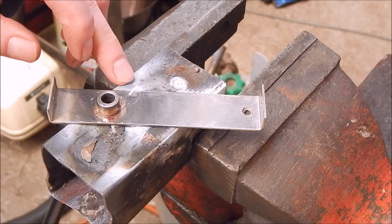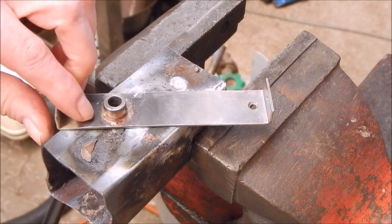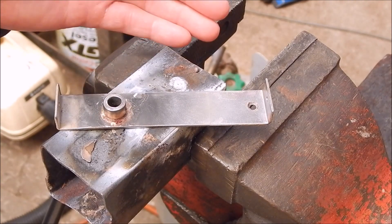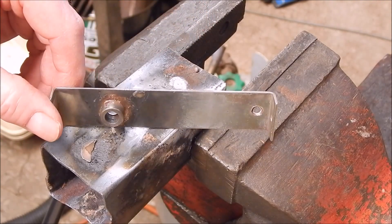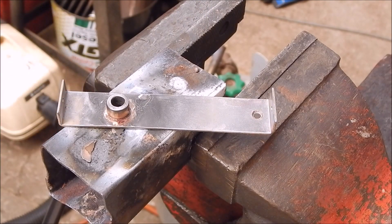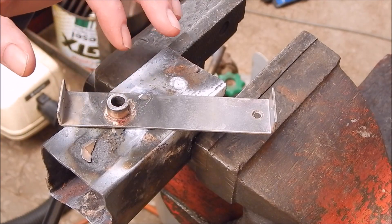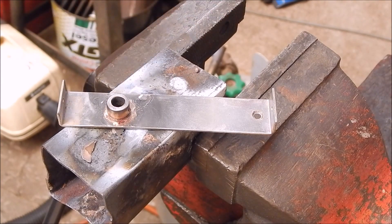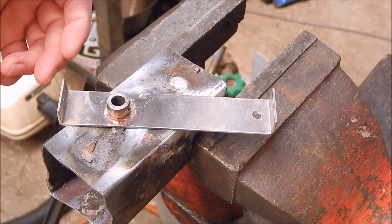There's our finished job — turned out okay, 100% bond. You always get a little bit of spill because bronze runs very easily, and well, if it's not running, it's not hot enough — that's what it comes down to. This is how you want to do finicky, fine work. The beauty of it is you can always disassemble it — you just reheat it and it'll all come apart again. That's it for me, I'll see you next time, cheers.